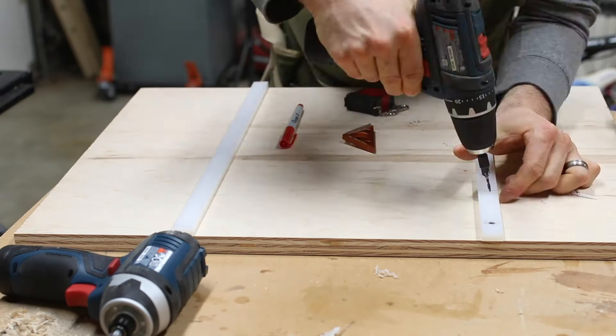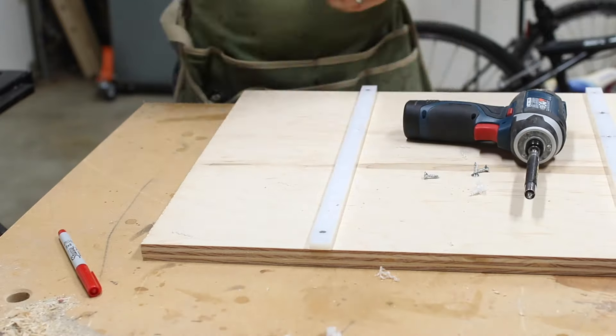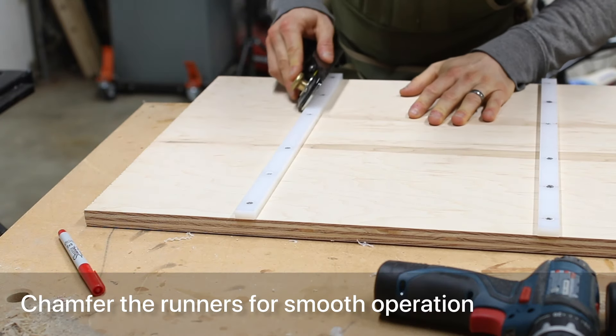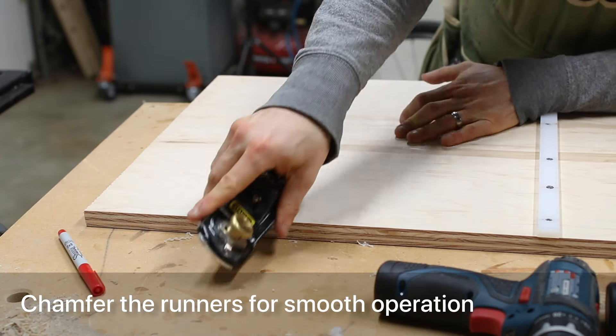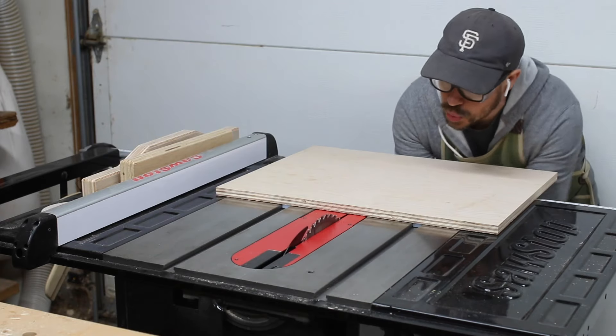While I finish the sled base, let's talk about the downside of the five cut method. While the cutting process itself isn't that difficult, the adjustment formula can be. It's a four-part formula that, if you mix up even slightly, can give you some really incorrect answers.